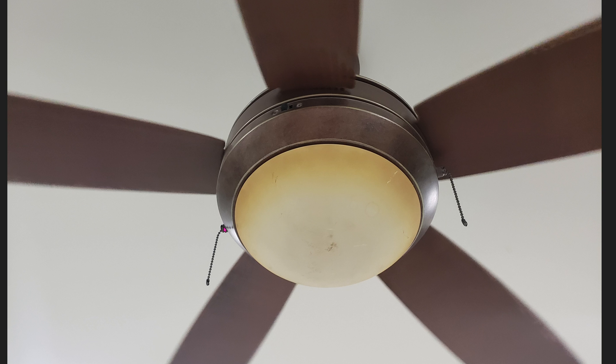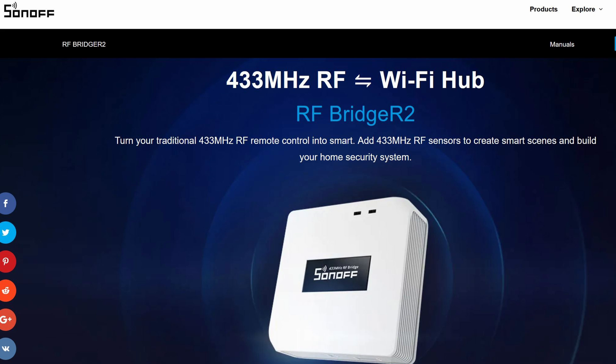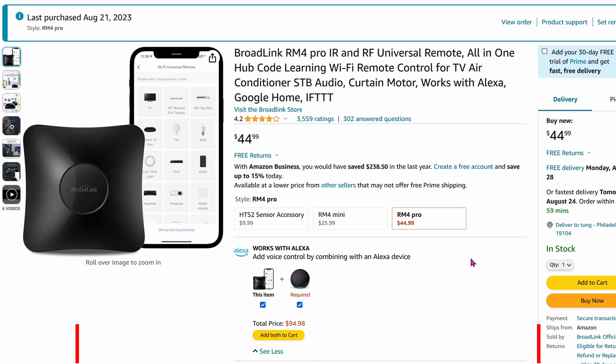From this perspective you can see there are two switches: one to turn the light on, and the other to control fan speed. Because you've installed this remote module, there's no way to manually adjust the speed or the light anymore. I think that's kind of a downside — it would have been nice to still toggle it manually via the pull switches, but that's not possible. This fan module is 433 MHz. Unfortunately there's no way to use the Sonoff RF bridge to control it. If you want to control it via an app, you'll have to use the Broadlink RM4 Pro, which lets you control both IR and RF devices. In the next video, I'm going to show you how to use this universal remote with Home Assistant so you can control basically everything in your house, including this fan module.